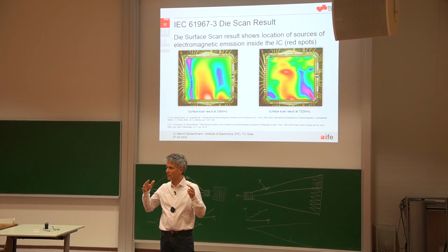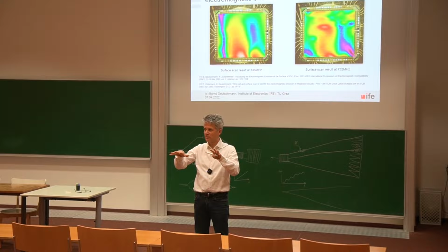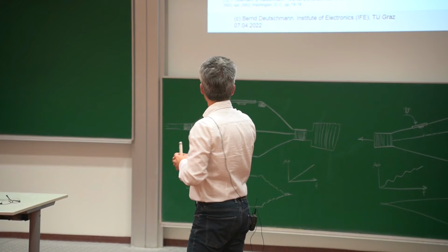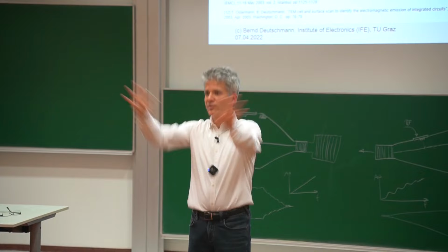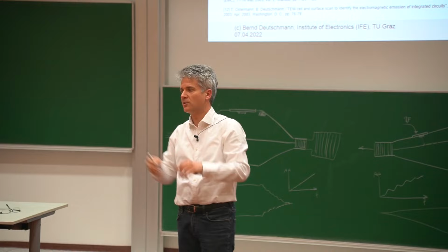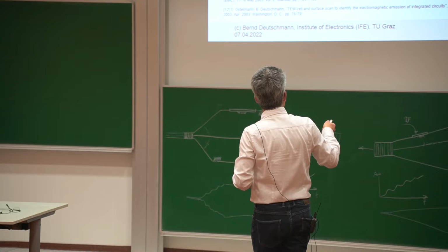and the clock tree extraction tool is usually extracting the clock tree in a way that it's generating a lot of clock buffers to further amplify the clock signal so that the clock can be distributed all over the chip in the same way, as synchronous as possible. So it's not just here at the oscillator pin, where there is an oscillator with a big clock driver, which is then driving the whole clock into the microchip. So, there is a clock driver, but it's distributing the clock signal to different areas, and there are additional buffers to amplify the clock signal and to provide the clock. But unfortunately, the extraction tool, or the place and route tool, was placing quite a lot of these X20 buffers, so the biggest buffers, in a close proximity.